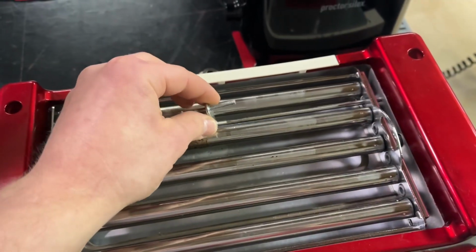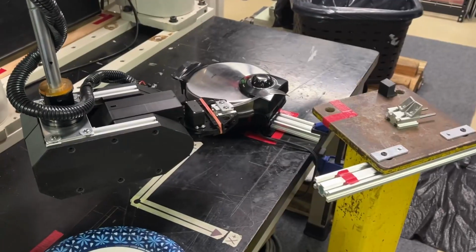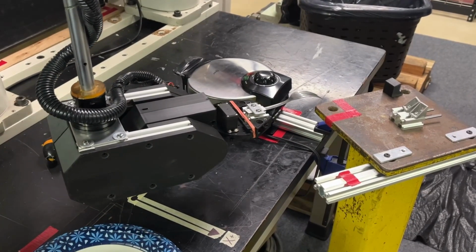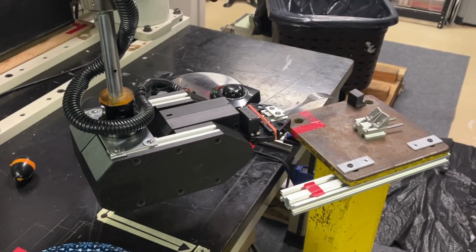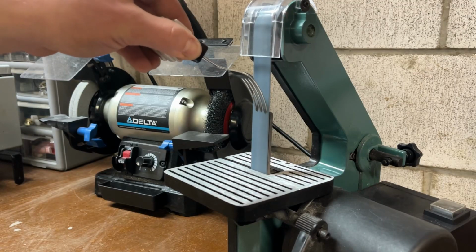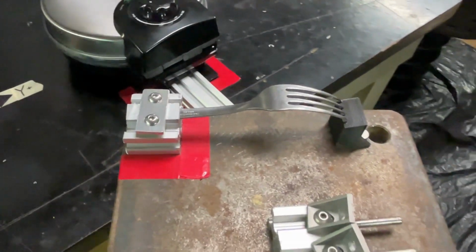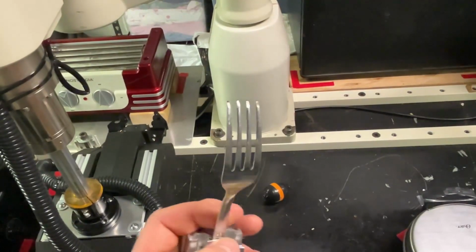But once again, another problem is how to get it off of the sausage roller onto the plate. Since I couldn't reach it again with the gripper, I had to make another tool that had a fork on it, so I could fork it and then put it on the plate. I took another piece of aluminum profile about the same size as the egg manipulator and attached a fork to it. And to make it easier, I also sharpened the fork so it stabs better.